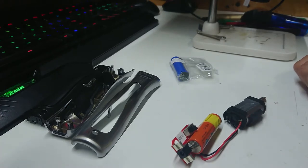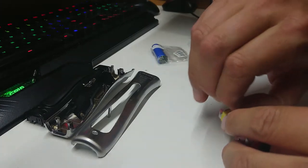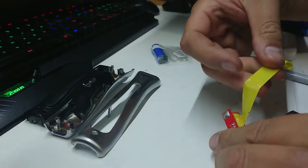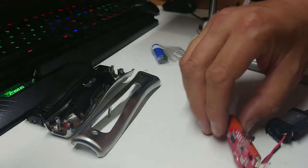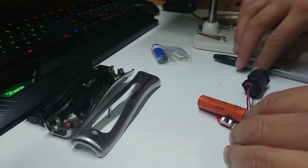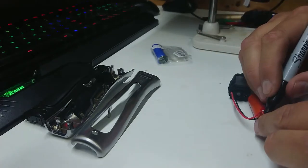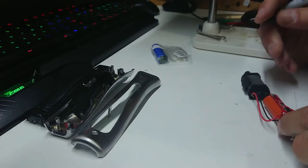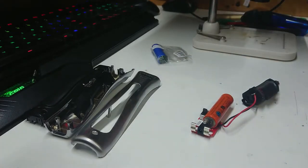Let's get some tools out and get sorted. First thing I'm going to do is take off some of this tape - looks like fancy Kapton tape or colored stuff. It'll be high temperature tape, not probably strictly necessary but I think that's what they use to hold it in place before they solder it. Next thing I want to do is observe the polarity here and mark it on the board so I don't do something stupid. That's a negative and that end is clearly our positive, and it is marked on the battery.